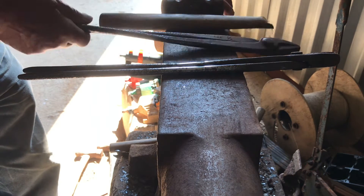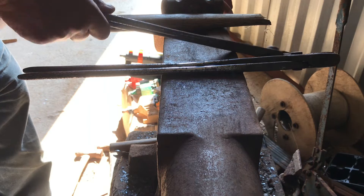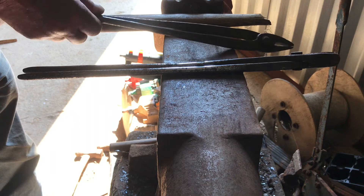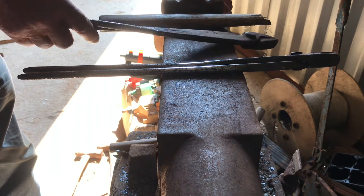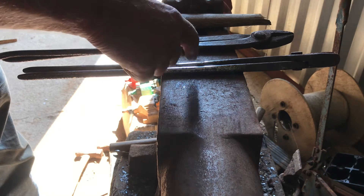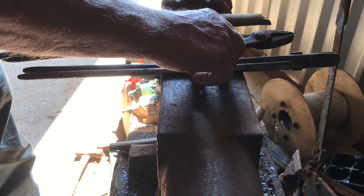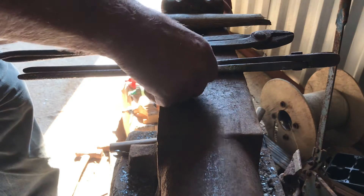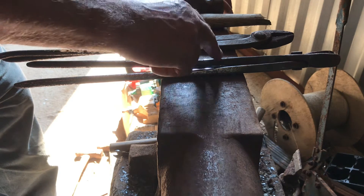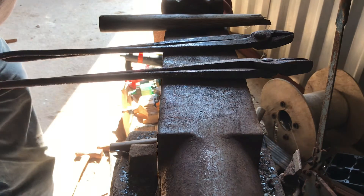The father's tongs — I would say they were welded. I can't actually see the weld on there, but he was a better workman than I was when I was an apprentice. Originally the handles would have been fire welded on, and it might be an idea to jump up the end of the bar you use for the handles — that'll give you a bit to get rid of any signs of the weld. But with a MIG welder these days, you can just stick another bit on there and grind it back so it all looks lovely and invisible.